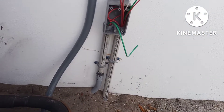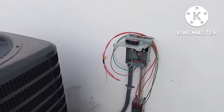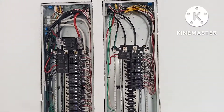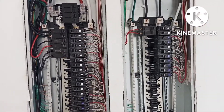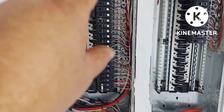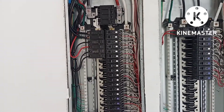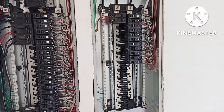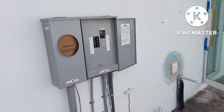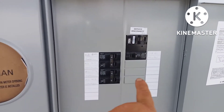Made a loop to go to the other one, and that box is still for the GFI which I'll get to later. As you can see, I got the panels all made up — got the arc faults on one side, two poles on the other side, three-wire going feeding the breaker, 200 amp main breaker, another 100 amp feeding that panel.